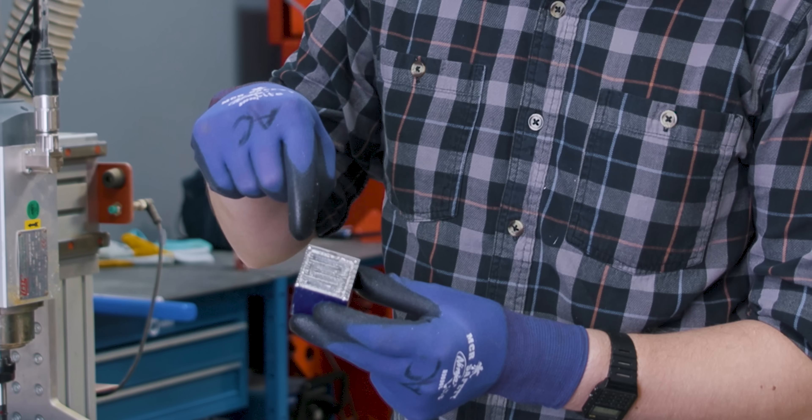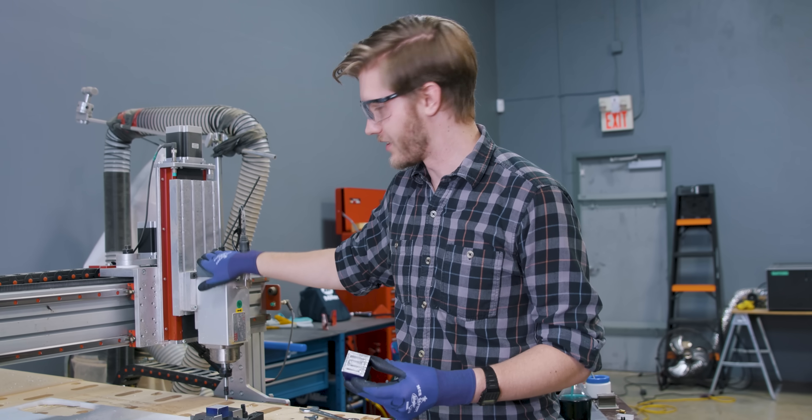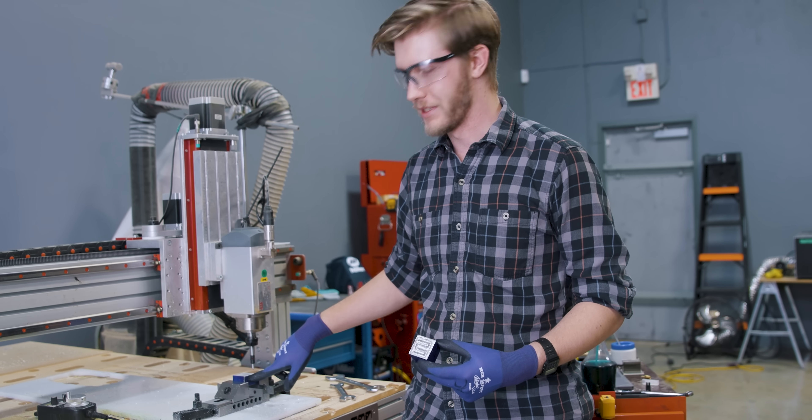On our first part here, where we wanted this to be isn't quite centered on the stock. The problem is that the router, although it looks pretty smart, is actually pretty dumb. We need to be able to tell it really accurately where both edges of our material are. Normally you'd use an edge finder like this one — it spins around with an eccentric spring and does a little kick when you get close to your work.